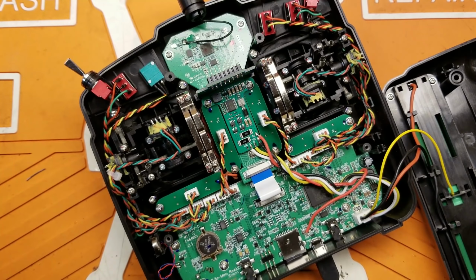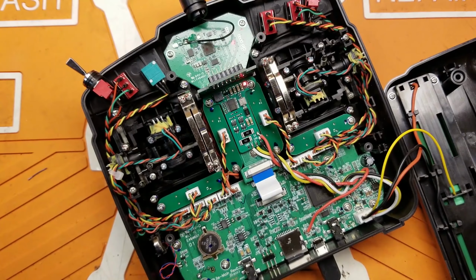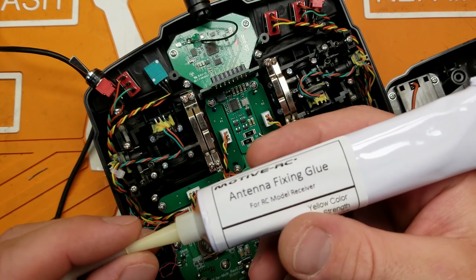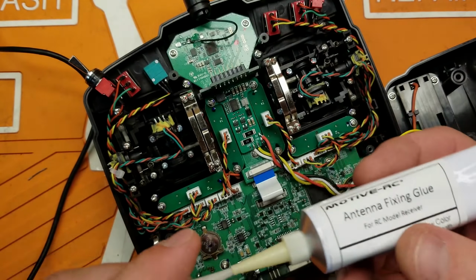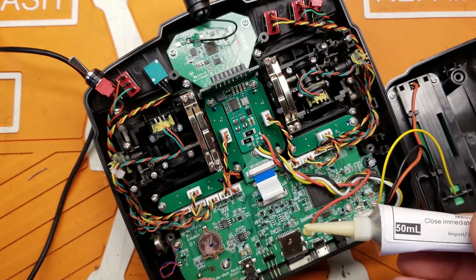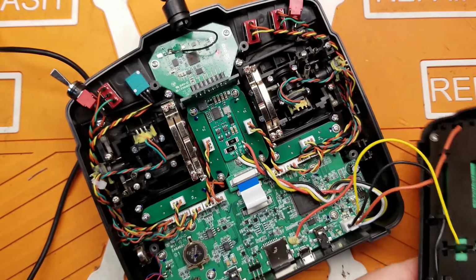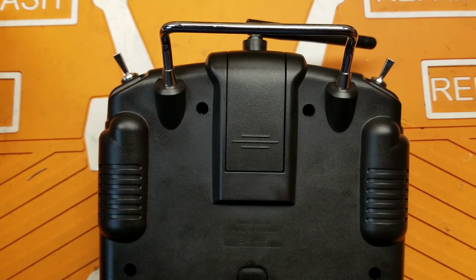All we gotta do is put some sort of Celastic on that guy, and we'll be all set. So I typically use this antenna fixing glue. This is the kind of stuff that you would get on an antenna or VTX. I'll put a link to this in the description. It's pretty good stuff. Just put that there, and well, that'll be that. Go ahead and button up your battery door, or the back of your radio. 4 screws.